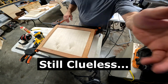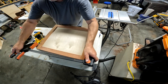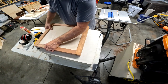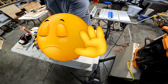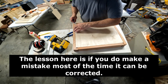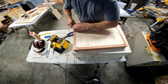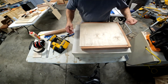Remember: this side's glued, this side's not. Take my clamps off. You can leave that clamp on longer if you glued this more, or shoot a couple brads into that, or dovetail it wherever you want to attach it. I should edit that out because everyone just watched me nail on the end that's not supposed to be nailed on, including myself. So I'm taking a little small micro driver and bringing the brads back out of this side. I'll pull the pin nails out and clean the glue off of it.